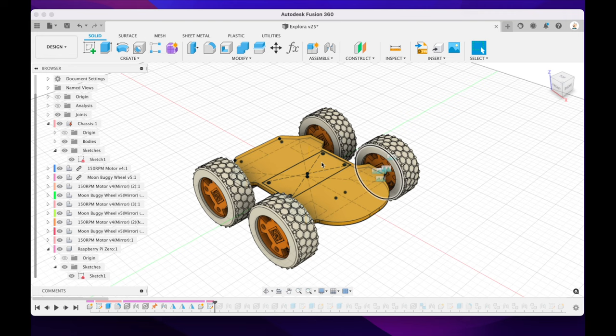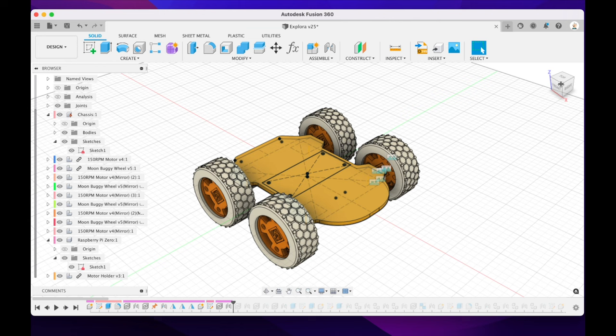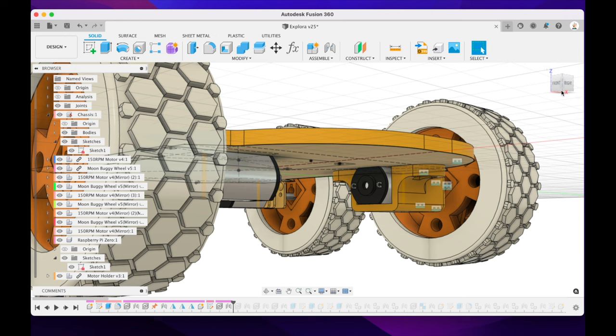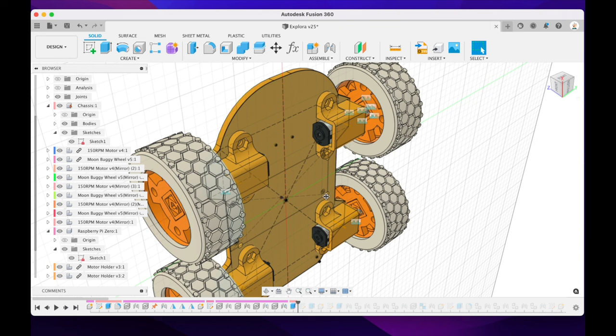I've also designed a motor holder component to hold the motors in place, brought in as a separate sketch. I do a rigid joint underneath the robot so the motor holder holds the N20 motor in place very firmly. These little motor holders take an M3 nut and an M3 bolt — once we punch holes through the base plate for those, we'll be able to screw them in very firmly. I then duplicate and fix the motor holders in place so we've got four of them, and simply punch through some holes so we can screw them in.